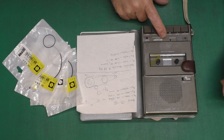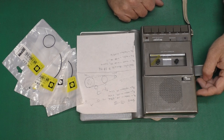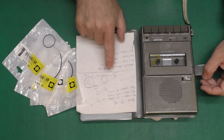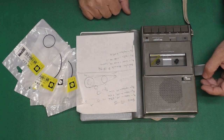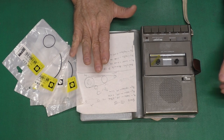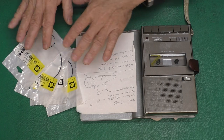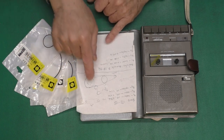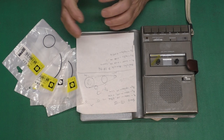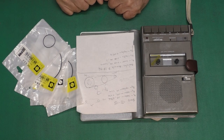Well, now it's time to move on to our Sharp CE-152 tape deck. I've got the map I've made of how the original belts went on. I wasn't quite sure on two of these what length they were. There were a couple different choices in that size range, so I bought one of each. And for the counter, there was only one choice. So when we find out which belt it takes, I will put that information in the description down below.